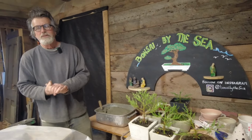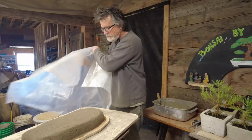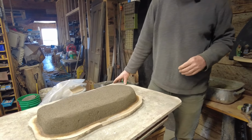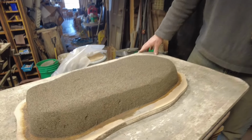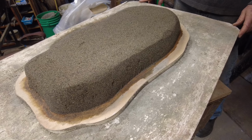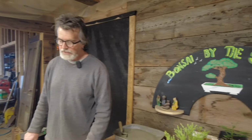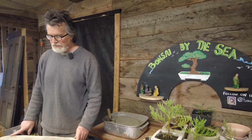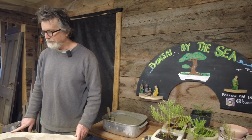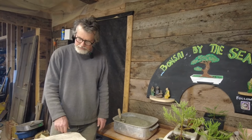All right. Well, it's the next day. And here's our beast. I didn't make this pot yesterday because I was concerned that the sand might be a little wet, and I've had real nightmares with them if the sand's too wet. The Portland can react with that water and become more soupy and be a big problem. So we're ready to make her now.